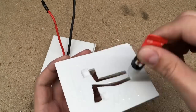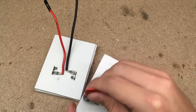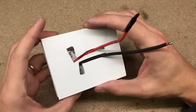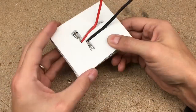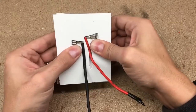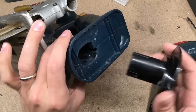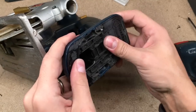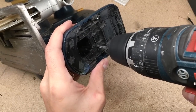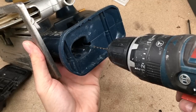Cut an additional layer to cover the terminals and wires. With fast-drying superglue, glued the last sheet in place. Then make a hole in the battery top part and use it as a template to mark and drill a hole in the power tool body.